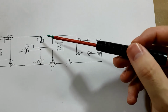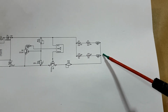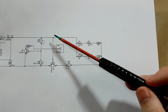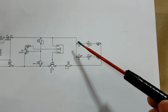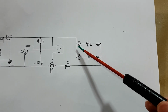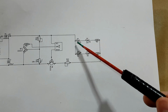So we're going to be focusing on this half of the circuit right here, the LEDs. I've also removed these resistors here, and I've removed this potentiometer because the voltage drop I'm getting makes these superfluous. They really don't have any purpose at all anymore. I'm using red LEDs right now instead of the orange ones because the red LEDs are working much better. The red LEDs work much better in here just because they have a better forward voltage for pairing them up like this.